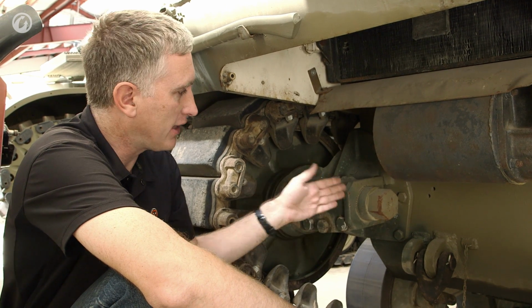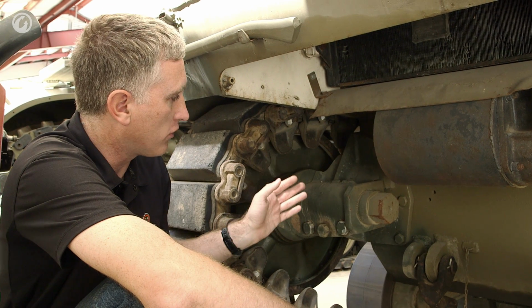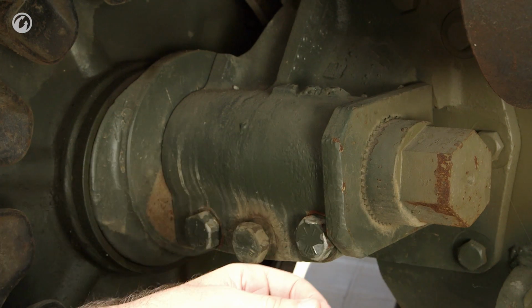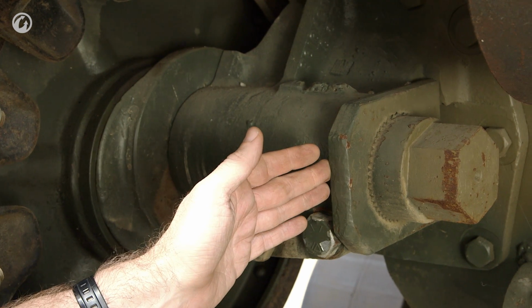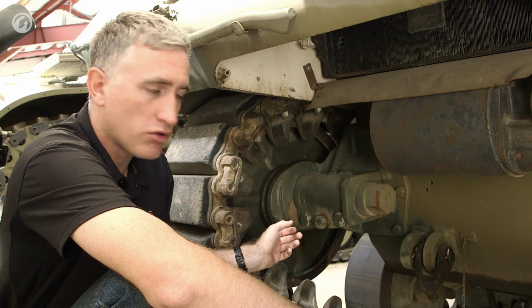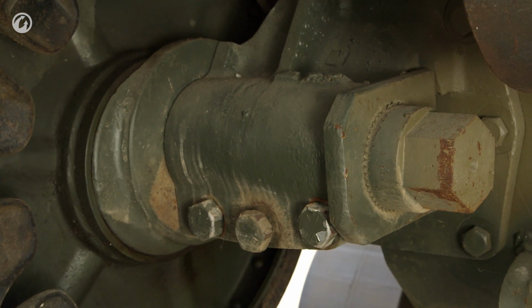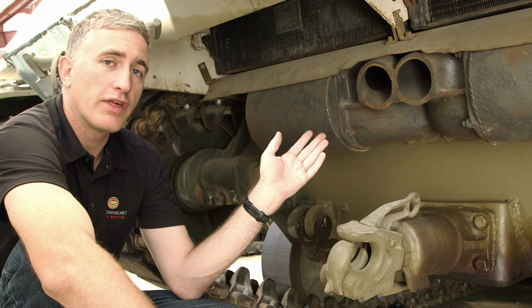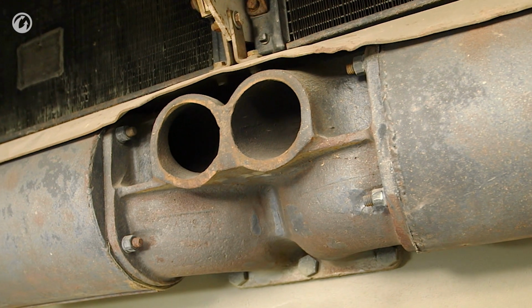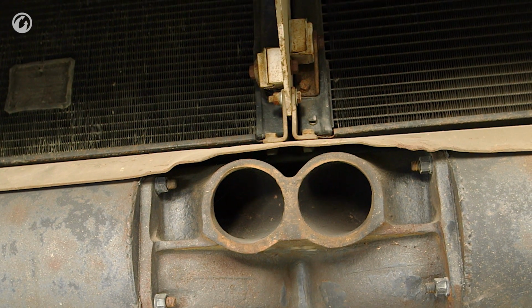You can then use Little Joe and a couple of lads to lever the idler wheel forwards and backwards. When you're done, put the locking plate back under the clip, loosen the spreader bolt, tighten the clamps, and finally you're done. While we're back here, we can also see one of the easiest identifiers of a Mark 1 or a Mark 2 Achilles, and that is the exhaust.